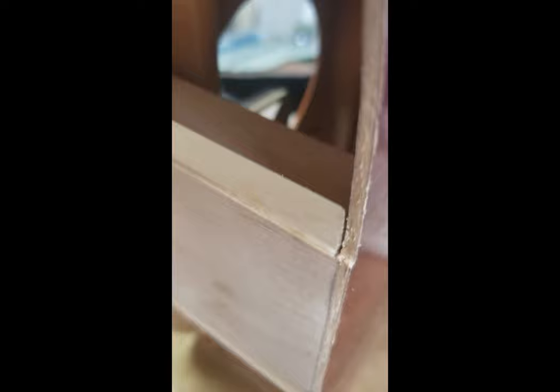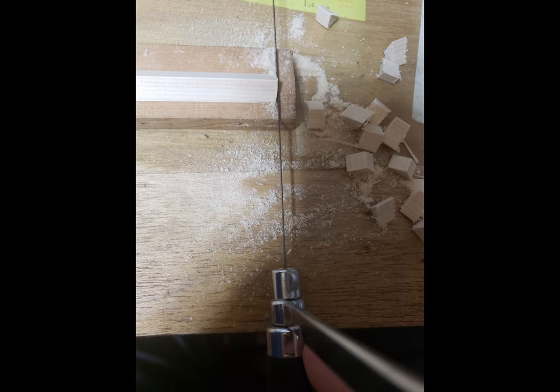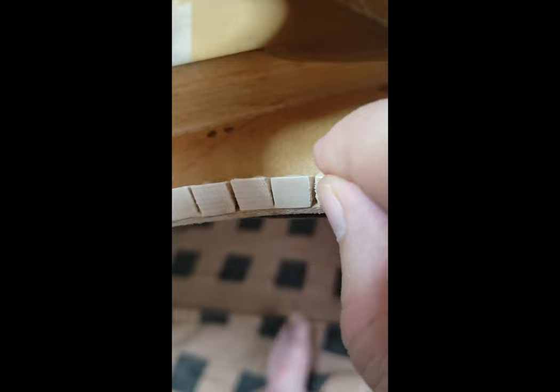And to increase the gluing area, I used these little sort of shims and then also worked on making some what are called dentellones, these little pieces of wood that you glue along the side to make sure that there's a bigger gluing area than just that little edge bit. So you can see I glued those along all the curved edges and used the shims on the flat edges and then made it all flat for a good gluing surface.